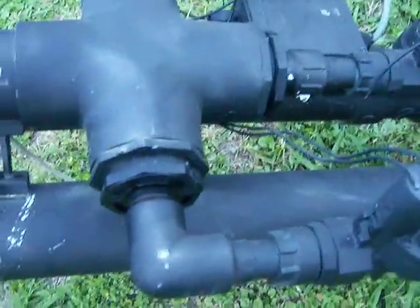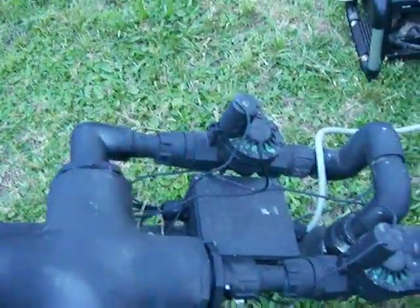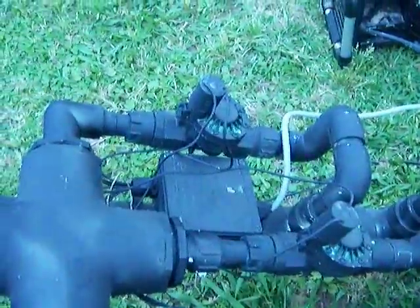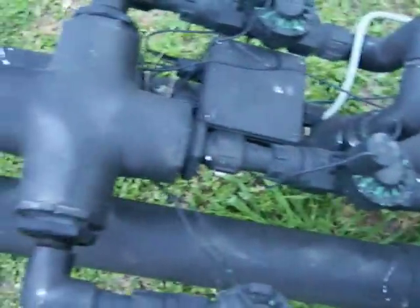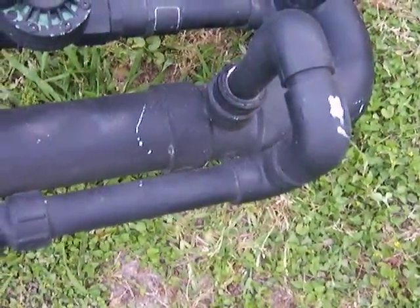Then when you get to this area, I have three one-inch valves. These are irrigation valves and there's three of them, so I can get as much volume as possible to the pipe as soon as possible. You can see how it manifolds out, so that line runs directly into the main tank below.